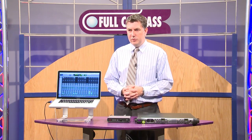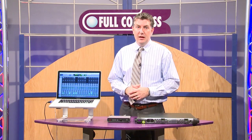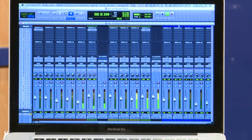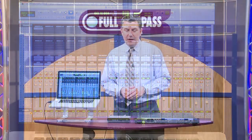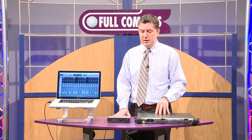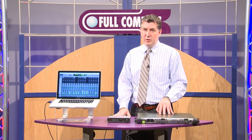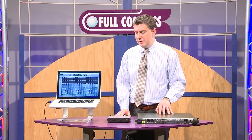And this is important, especially for folks that I speak with that are doing live recordings. The front of the house guy might just have a laptop handy, might be controlling lights or something with the mix system. And at the same time, they can run Thunderbolt to the Thunderbolt chassis here and to their interfaces, and a lot of folks are getting up to 64 in and out with just this little box here.